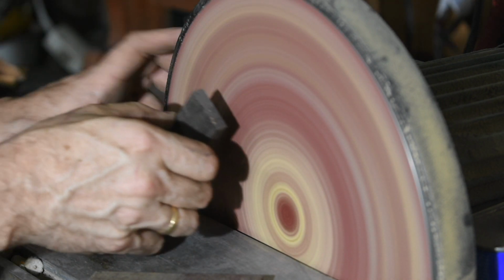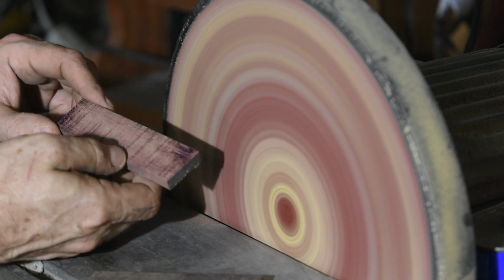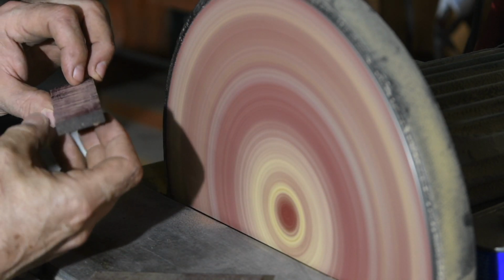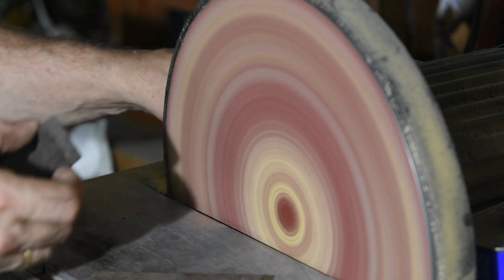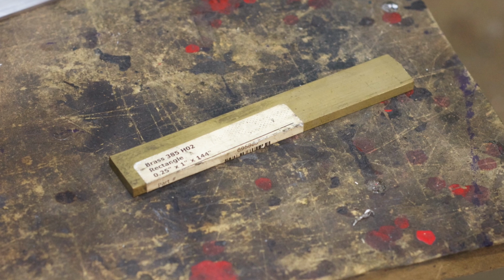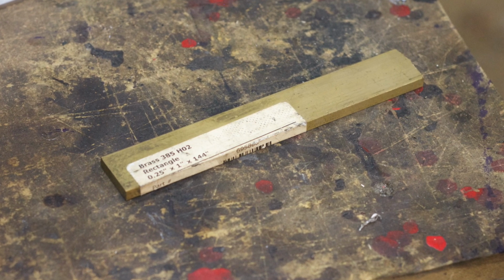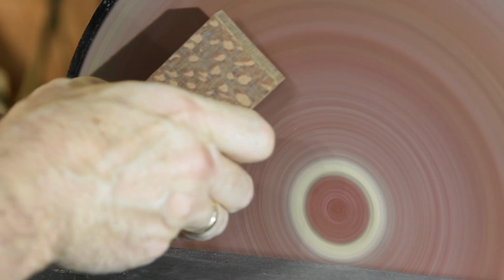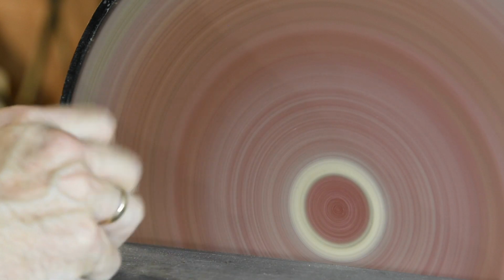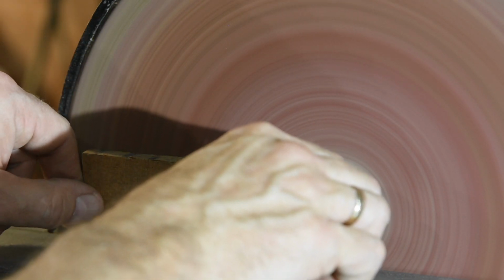As with all abrasives, heat will build up. You want to dip metal parts in water to speed things up. This is important for two reasons. First, you can cause warping so that you think you got it flat and then it cools down and the piece turns out to not be flat anymore. With plastics, you can actually melt it or create damage to the material. With wood, you can heat it up so much that it'll cause it to crack. So if I'm doing handle scales, for instance, I'll switch from piece to piece, letting them cool as I work.